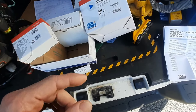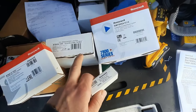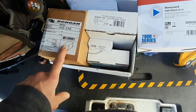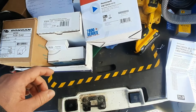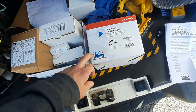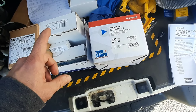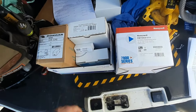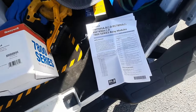What's up guys, so today I've got a new 7800 series Honeywell flame safeguard. We've got a sub base, the amplifier, and the purge timer, and I've also got a new ignition spark transformer. These things don't fail a whole lot in my experience — most of the time you have another problem. We're doing everything because it's a 77 series and all the parts are obsolete on the old burner control, so we had to go with all new controls. I'm gonna have to RTFM as well because I've never done this before.